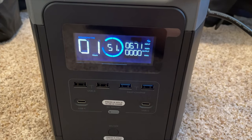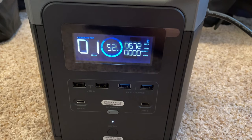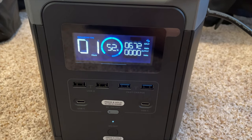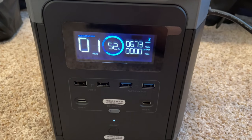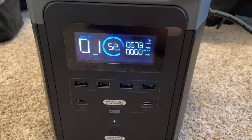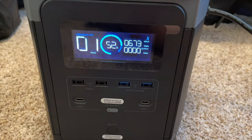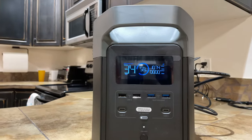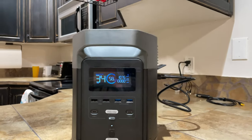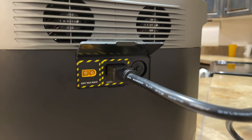This is what it looks and sounds like when it is charging. Because I had just received the power station outside from the cold and shipping, it is charging at a much lower rate — about 670 watts at 52% — because it is so cold. In the second clip, once it has warmed up on another day, you can see it is charging at about 1070 watts, which is an insane amount of power.